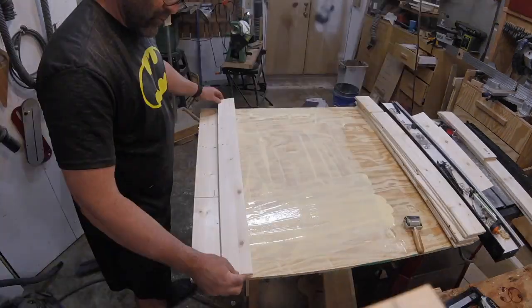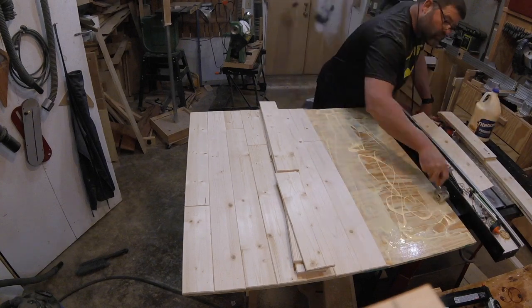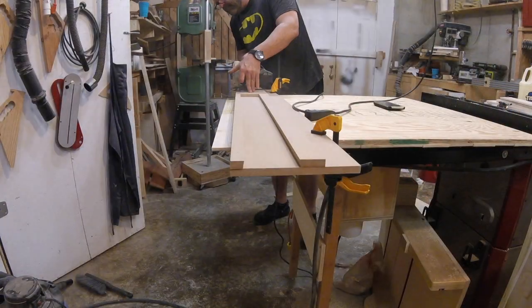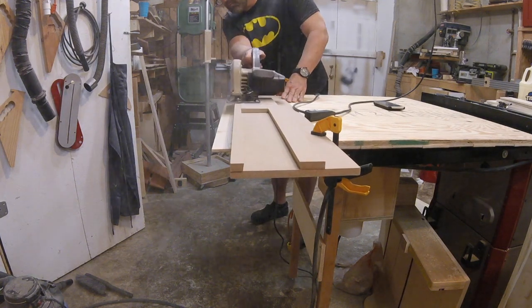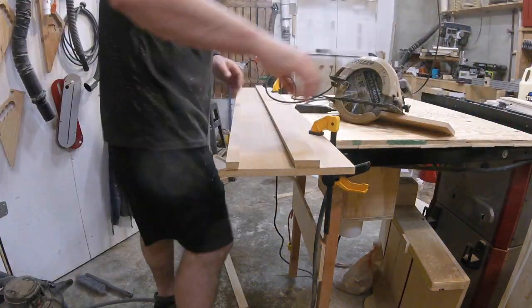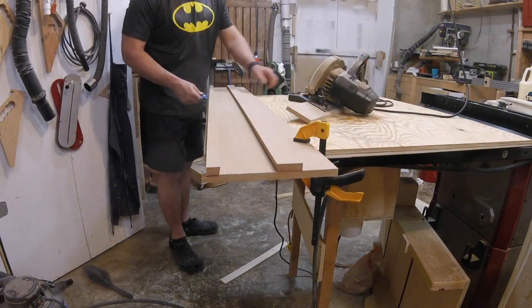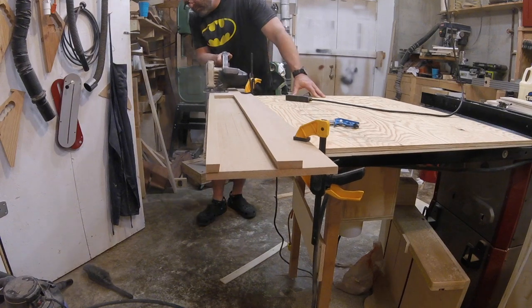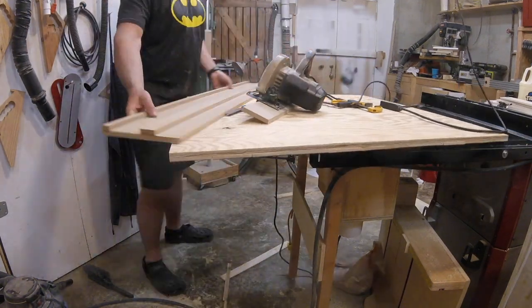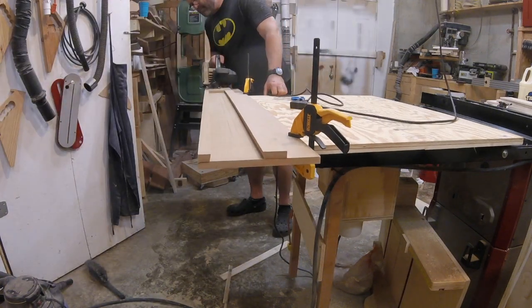Now it's time to glue it up. After spreading the glue, I tack the planks in place using pin nails. Now I can cut the board down to final dimension. Because the sides are slightly uneven, because the boards are tacked onto plywood, I'm using my homemade track saw to get perfect edges, and I'll leave a link to the video of how I made it in the description. Notice how even though the work piece is moving around, the saw stays in the perfect location. Try that with your average homemade circular saw guide. This track saw is awesome, and it costs less than $20 to build.